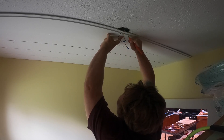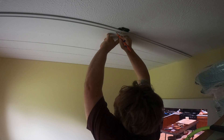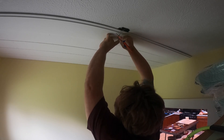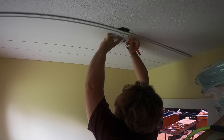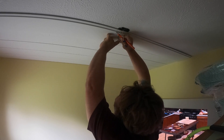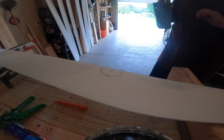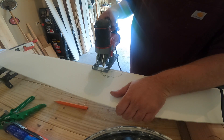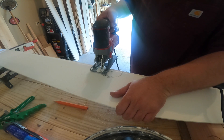You can see right here I only have one light fixture to mark on this ceiling. In any finished type of work like this it's easy - just hold your board up there and mark your board, and to measure for this box you're going to be way more accurate. So I'm just marking it out. It is an octagonal box, and I'm kind of cutting one half of the octagon right now.